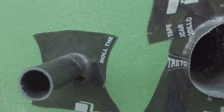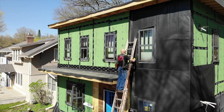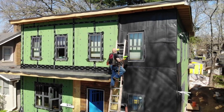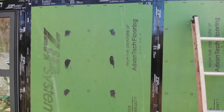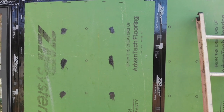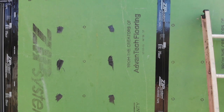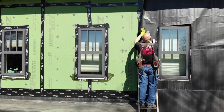With the windows and the holes in the wall sealed against leaks, we're ready to begin the rain screen process. But first, a quick answer to a question that's sure to come up: do you have to seal all the nail heads on the zip system sheathing products? No. The answer is no. Fasteners that are deeply overdriven should be sealed with a piece of tape or liquid flash, but what you see here is overachieving, not following the installation guidelines.